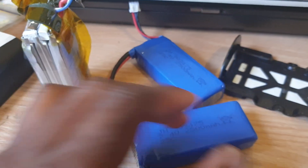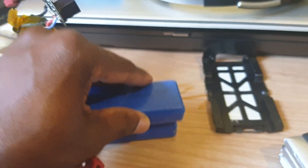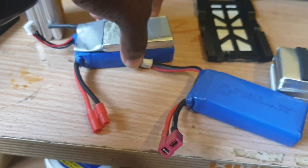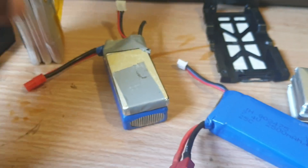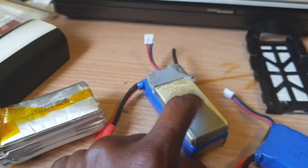But this time I'm going to do a slightly bigger battery — I'm going to do a 2,500 mAh. These are 2S batteries; I'm going to pull one cell from that and join it to here, so I'll pull a cell from this. Imagine me pulling that cell and putting it on here to make 3S, and then I'll take all that off and put it on here.